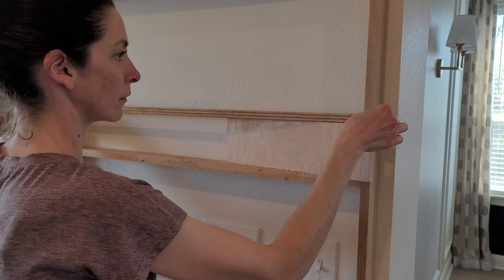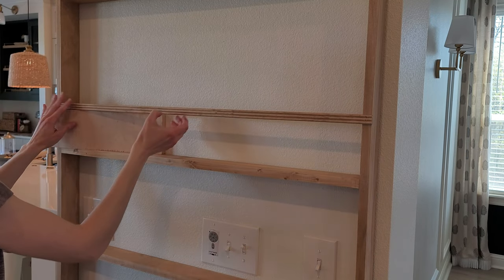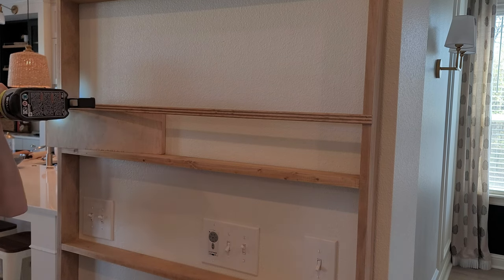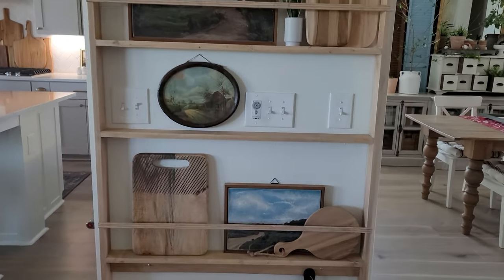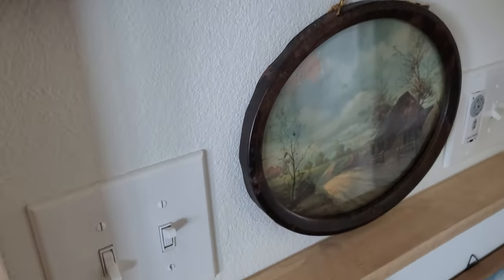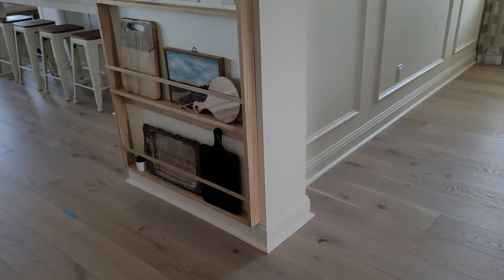I add the rails last because they're attached with brad nails. I hold the brad nail gun so that if the nail tweaks out it comes out left and right rather than through the wood. I use a board to help me level it, saving time on measuring and marking — just use the board and it's perfectly level on both sides, attached with two brad nails. With one rail across nothing is really leaning against the rails. I absolutely love this, and when I'm done with it and want to take it out, I only have to patch four holes. Please give me a thumbs up and subscribe — thanks so much for watching!